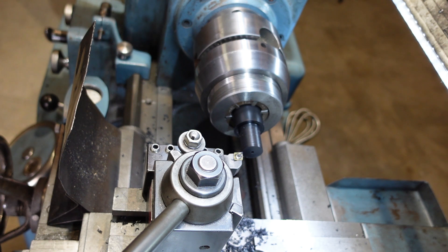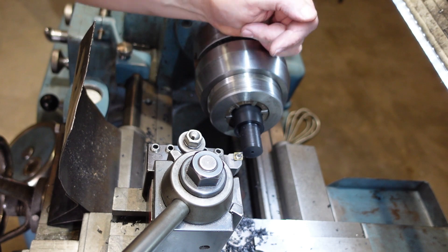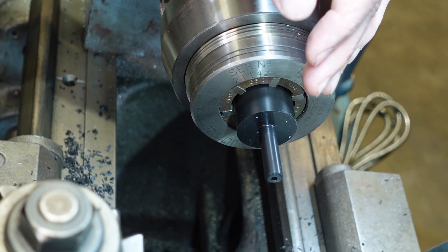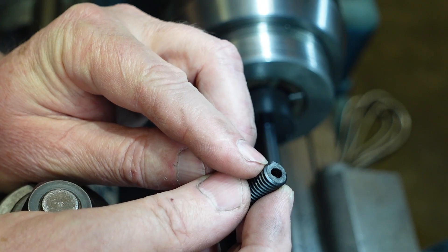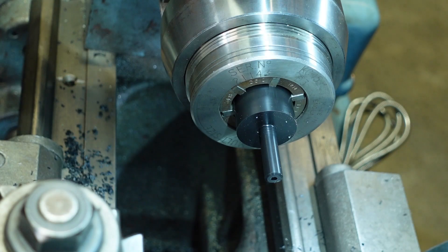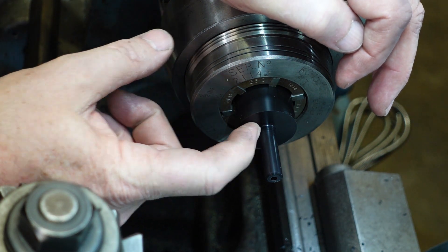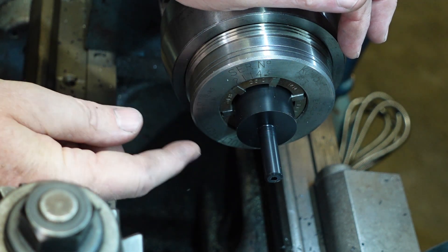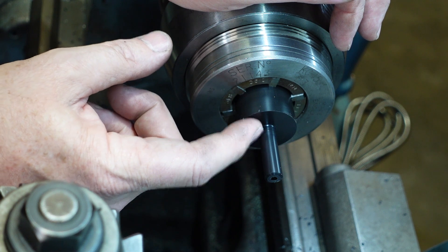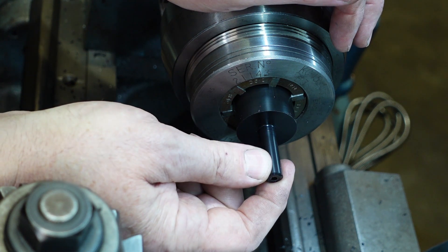If you take a more relaxed effort you'll get lots of stringy chips, so to avoid that: heavy feeds and reasonable depth of cut. For a finishing cut you may have to take a light cut or slow your feed to get a decent finish, but for roughing you can take quite deep cuts. Another property some plastics have is notch sensitivity — a sharp corner concentrates stress and causes easier breakage. That's probably what happened here: the bottom of the thread had a sharp corner and it snapped. With plastics, you're better off leaving that radius rather than cleaning up to a square corner — I'll leave it with the tool radius, about 0.8mm, to give it a chance against stress.